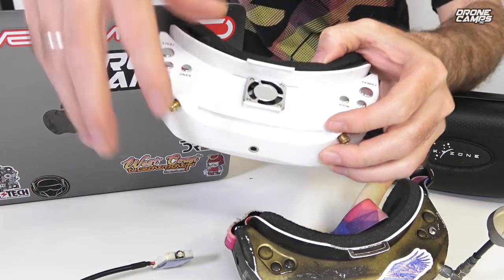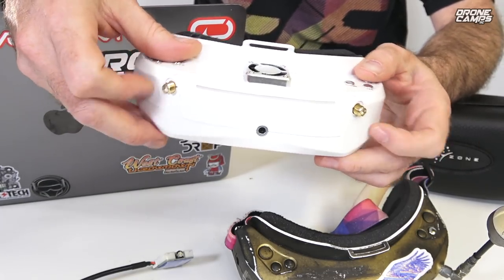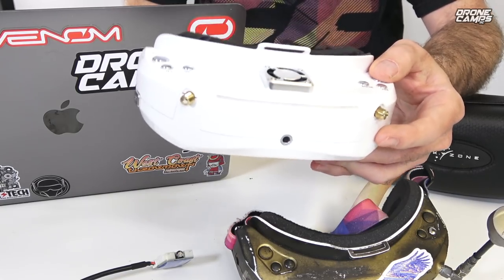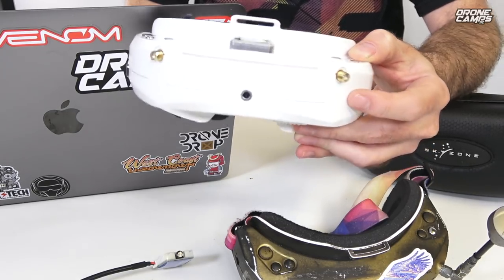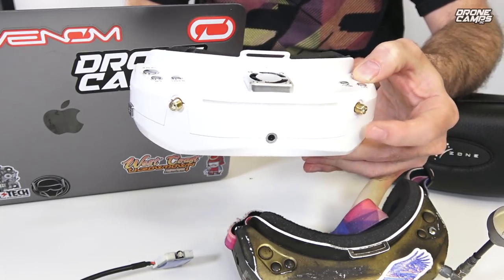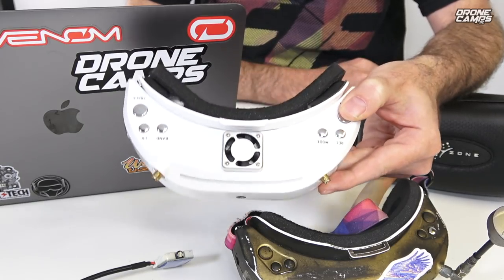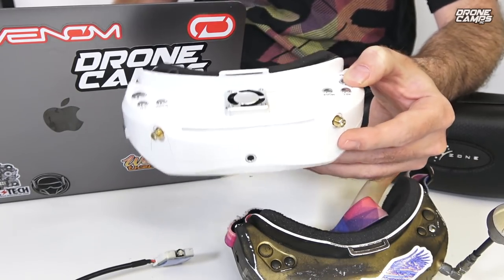The Sky O3s have a little broader field of view at 43 degrees — a little bit wider than the others, but it's pretty standard and you're not going to notice a whole lot of difference. These are 800 by 600 pixels resolution — a pretty nice image display. They record H.264 encoding for DVR at about 30 frames per second and support MOV movie format, compatible with both Macs and PCs. Also switchable between NTSC and PAL.